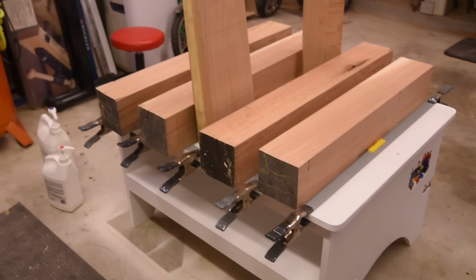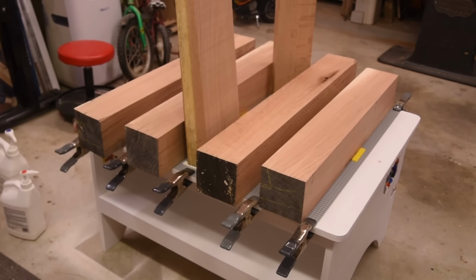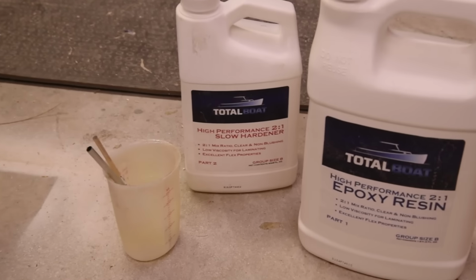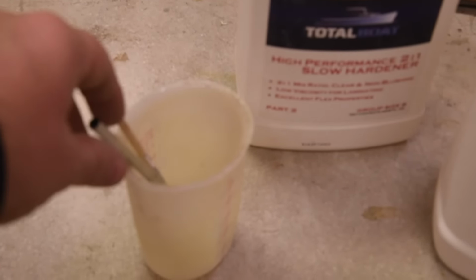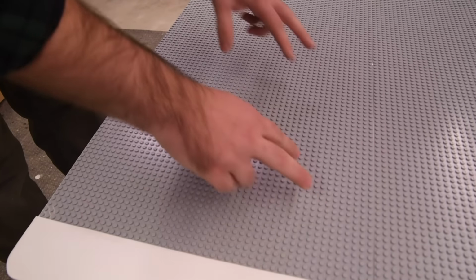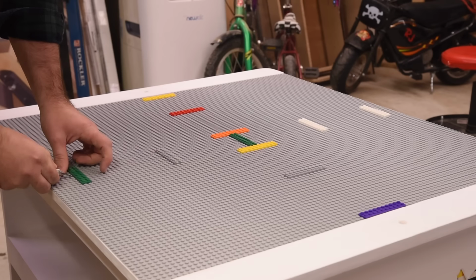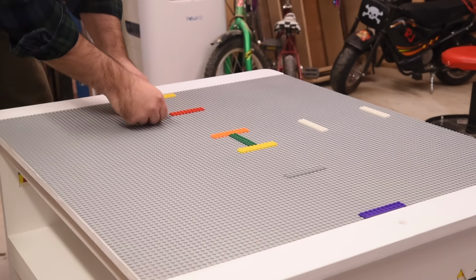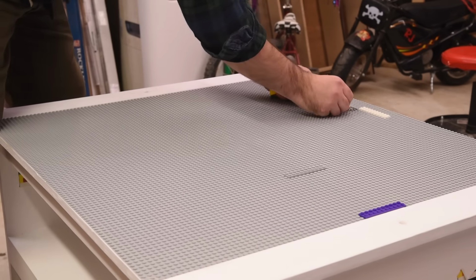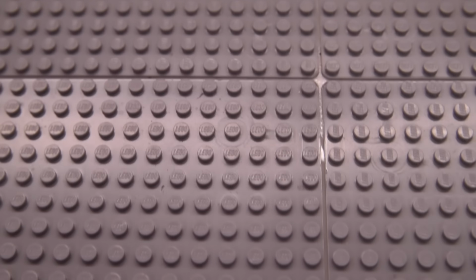So the last step was to glue the plates to the top. Unfortunately, I mistakenly thought I hit record and missed recording this step, but it's really simple. I used some slow set epoxy and brushed it around all the edges where the plates would be, and then painted some spots in the field of the plates, sort of in the same pattern as the 5 on dice. Some spring clamps and heavy wood served as overnight clamps.